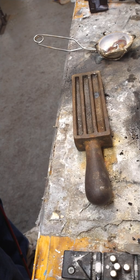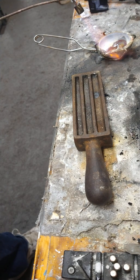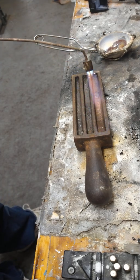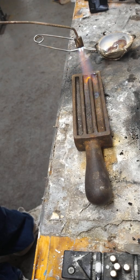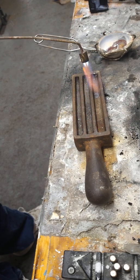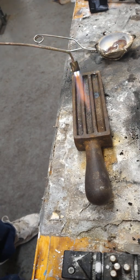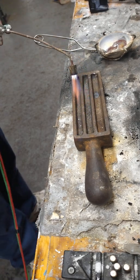As always, one of the first things you've got to do is make sure that your crucible and your ingot mold — or whatever you're going to be casting the metal into — is nicely heated up before you start. Hot metal in liquid form, gold and silver, hitting a cold piece of steel: think about what happens if you throw a drop of cold water onto a hot frying pan. You will get a small explosion.